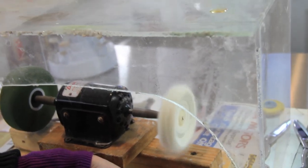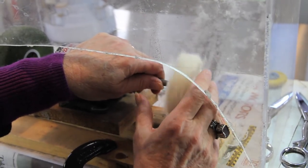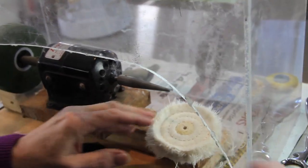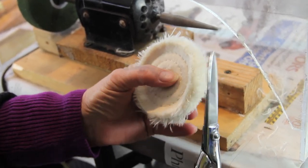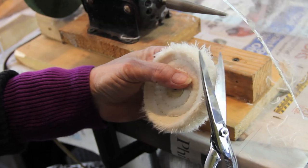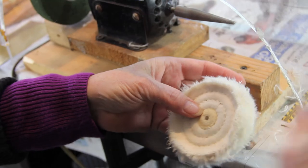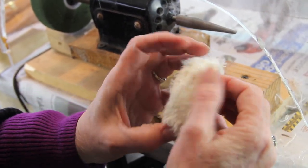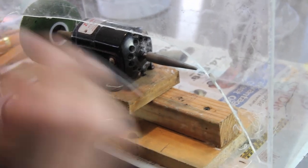That's probably good enough. Why are we doing this? Well, the fluffier it is, the more fibers we have, and the deeper it'll go into recesses. You want to trim off any loose stragglers and make it a little more orderly. This wheel is pretty ready to go — it's got a nice little fluff on it.